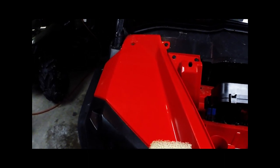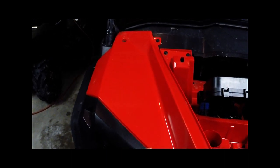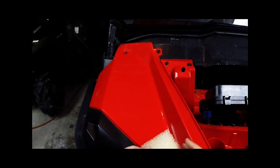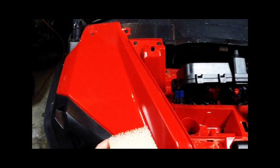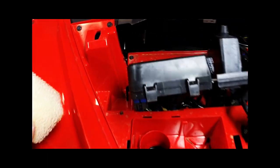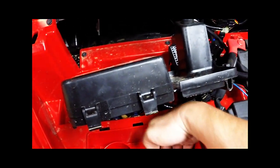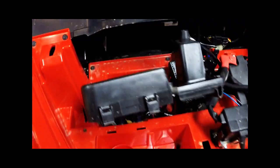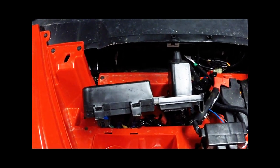If this filter were really dirty, being that the material is foam, I would wash it with Dawn if it had some oily dust. Being this is a dry medium, I wouldn't recommend spraying anything like K&N oil for trapping dust because that would really start choking this up. We take a look down in the box — there's a couple of twigs and maybe a little mud. This is the intake; this sponge material kind of sits in that corner.